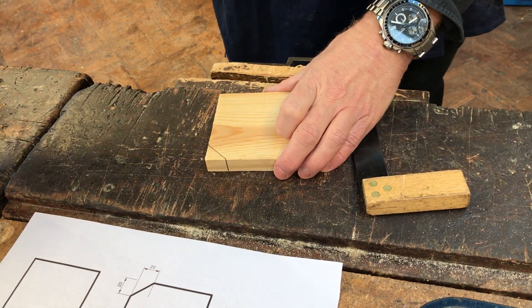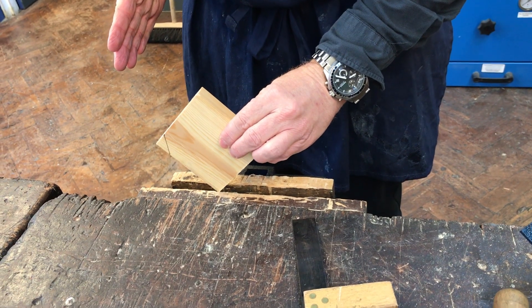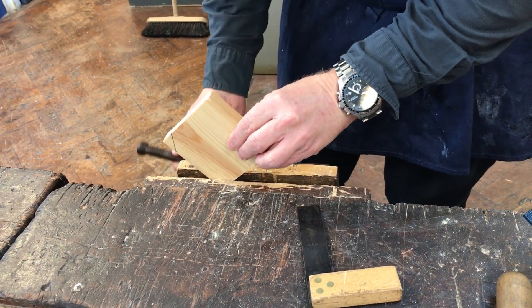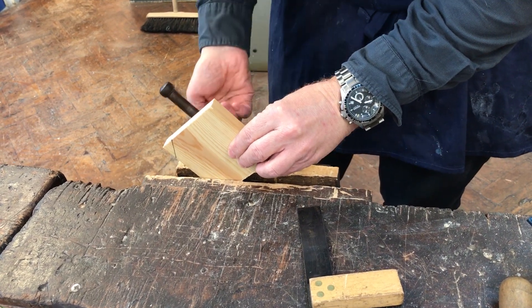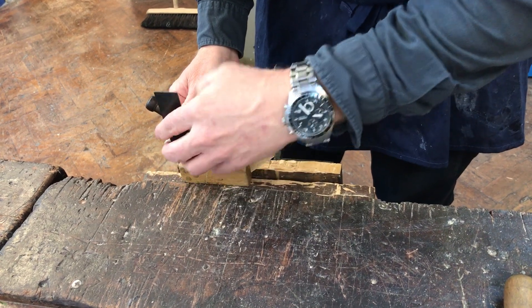When we cut material in the vise, we make sure that the line is vertical, so we've got gravity to help us as we do it. Make sure it's sticking out of the vise, and then try to get the line straight. You can use a tri-square to check that it's straight, but you should be okay — just do it by eye.